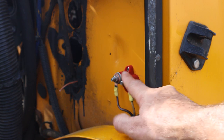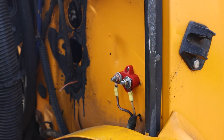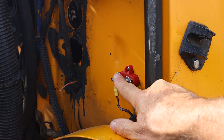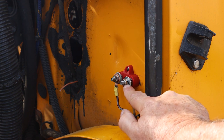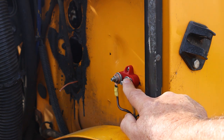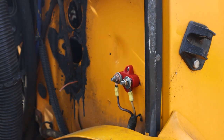Now we're going to put some dielectric grease on these terminals. Contrary to what everyone thinks, dielectric grease is not conductive — it's an insulator — but by putting it on the contacts, the ring terminals, the washers, the nut, and the terminal screw, it keeps these connectors from oxidizing and rusting, which is not good for the contact. That is pretty much how we're going to, at least right now, set up and bypass the door interlock safety system. Hope you enjoyed this video, we'll see you next time.